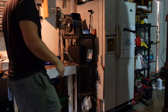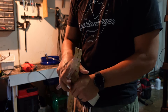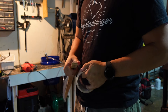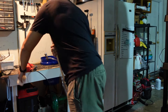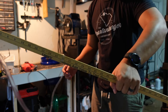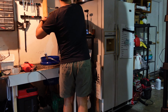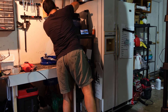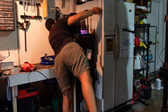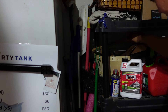So what I'm doing now is I'm putting all the hose behind the fridge — that way it's easier to work with and I can just pull it through and drain it. Now it was really hard to get behind the fridge and I didn't want to pull it out. So what I'm doing instead is I'm taping the hose to this stick, and what it's going to allow me to do is push the hose behind the fridge and hopefully get it to the other side without me having to pull out the fridge. And I got to say, it worked pretty darn well. I saw electricians use this before and it's just genius. If you look at the other side, it's right there — it made it so easy.